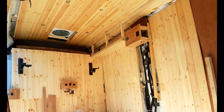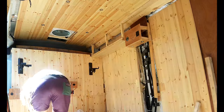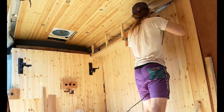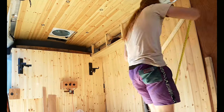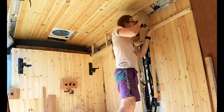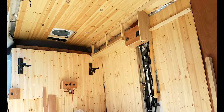I made this piece out of 12 millimeter poplar ply, in keeping with what I used for the rest of the upper cupboards. In retrospect I definitely could have gotten away with nine millimeter ply, but because it was overhead and would potentially be holding a reasonable amount of weight I wanted it to be really strong. This cupboard in particular ended up being the storage location for all my jackets and hoodies, so it really doesn't hold very much weight at all. I don't really want a massive jar of gherkins to smash me in the face or something like that.